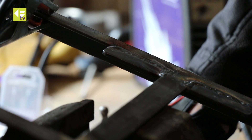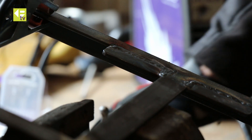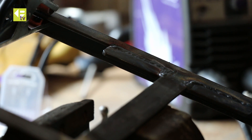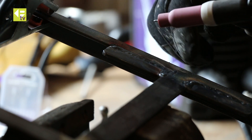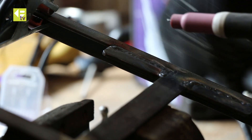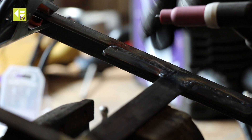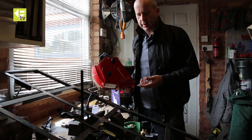So we've demonstrated how you can convert your stick welder into a very basic TIG welder. The disadvantage of this process is you're switching the gas on and off manually. Normally at the end of a TIG weld you want to leave the torch over the job to protect the weld material as it cools down, but in order to break the arc you have to lift the torch up away from the job. So there are limitations around controlling gas flow and gas coverage — it is a very basic solution, but it does allow you to weld thinner materials using a stick welding machine.